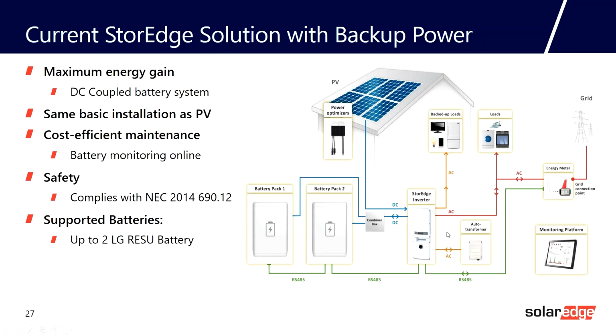So we don't have to worry about any other communication wiring. So that's 5 conduits. Preparation is key if you're going to be successful for your first installation. And I would say use a gutter box on maybe your first install, just so you have the space and the ability to move things around and make sure it's clean and tidy.